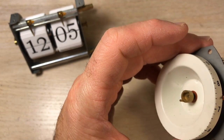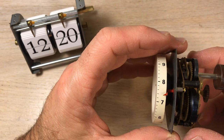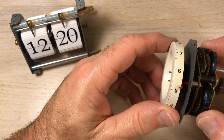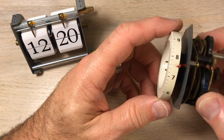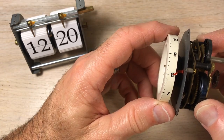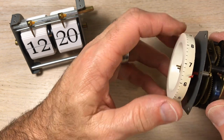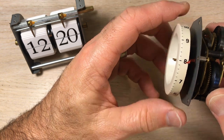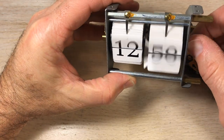This little brass piece is the part that's going to impact that clock mechanism there. I have to figure out how to get it set so that when I put it back together the time's going to be right. So I'm going to use the alarm function — it's going off around eight. What I'll do is set it to eight o'clock, then turn the hand, which would be turning the flip tiles. So this clockworks mechanism should be set to go for eight.